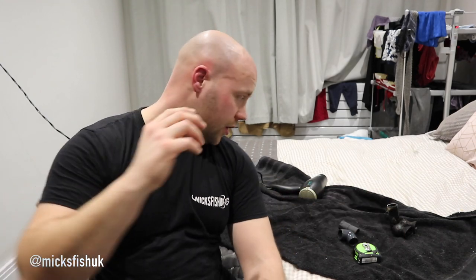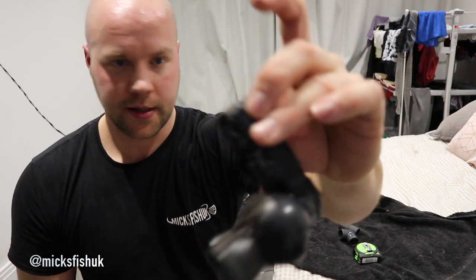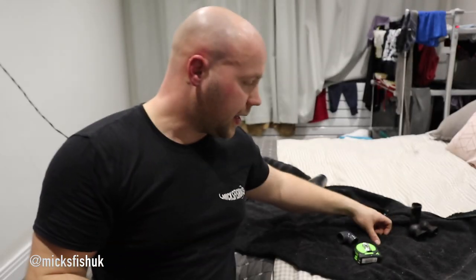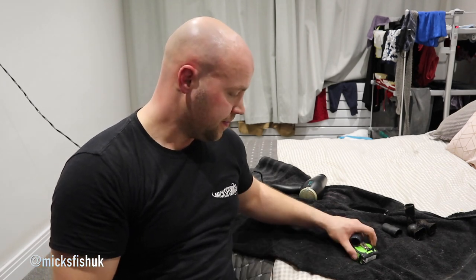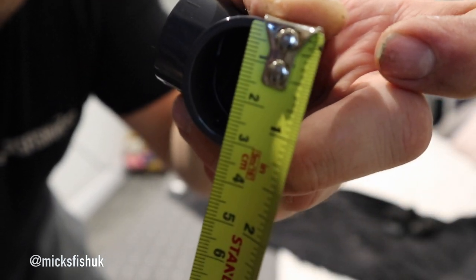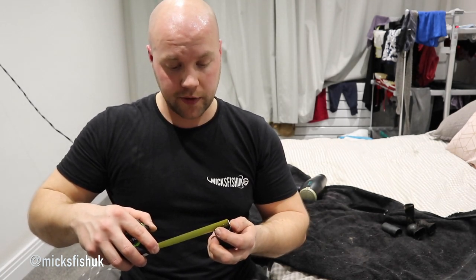While the tank is filling up, I'm going to go upstairs with a hairdryer and show you how to make it yourself. We're upstairs in the bedroom. What you're going to need is the original gasket - you can buy it off eBay, Amazon, or go to a plumbing shop like Plumb Base and they'll be able to give you a gasket that will fit. Then what you're going to need is a PVC elbow - you can get it in gray, black, or white, whatever color you like. The size it has to be is three quarters of an inch, which is like 30 millimeters, as you can see on the tape.